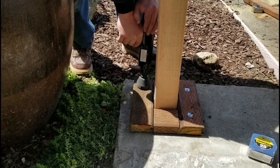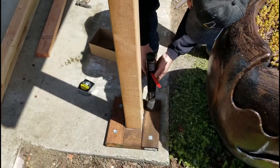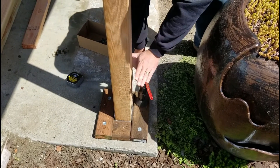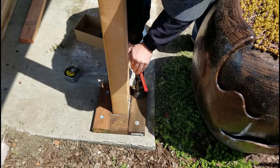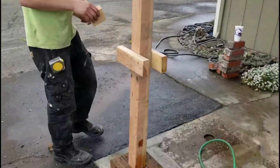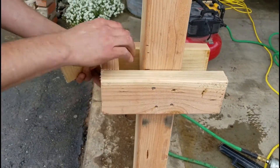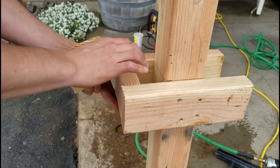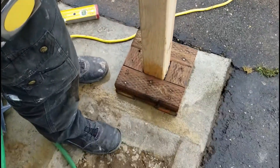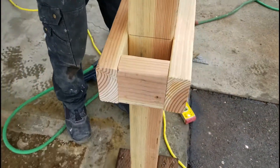Just to show you how it's done — this is what it sounds like. What we're doing now is we've got our base covered and we're just nailing now the top piece in. I'm going to get some nails in there. And we're going to end up putting a board on top of here all the way around so we get the same as what's on the base. Then we can run our studs up and down, then we can nail our plywood on.